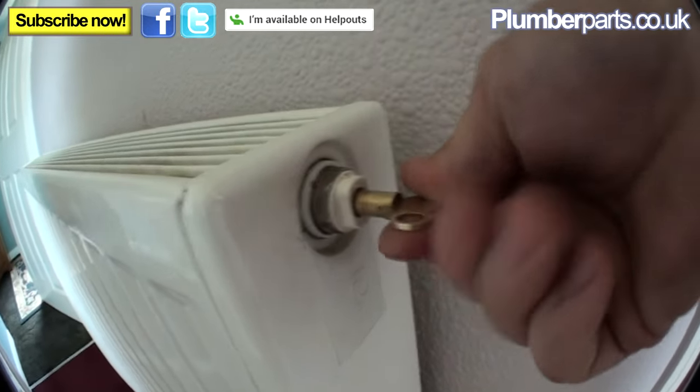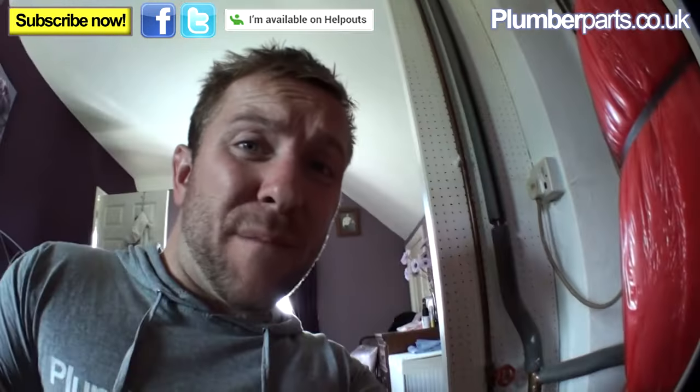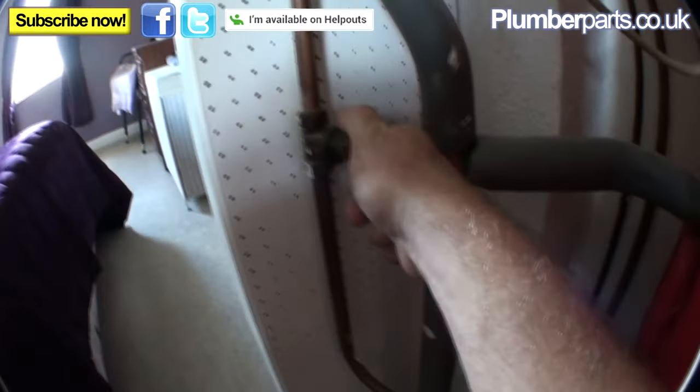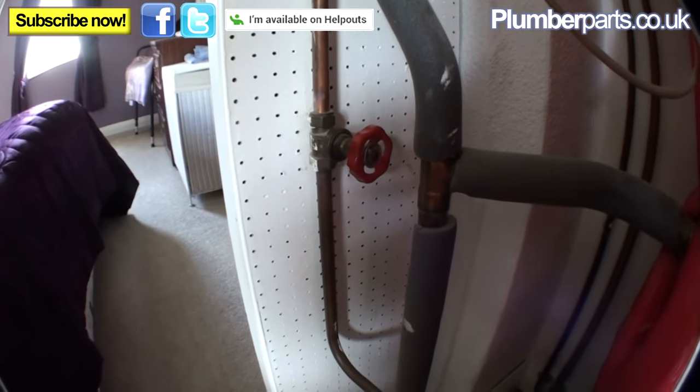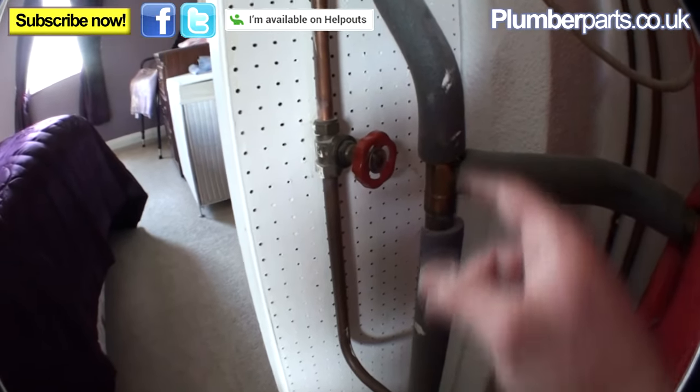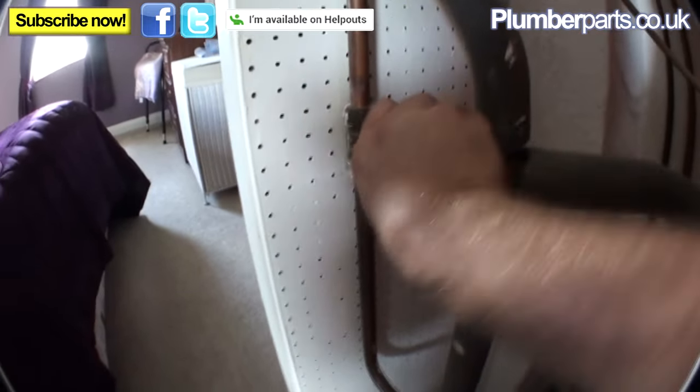You'll notice I turned it clockwise to shut it. So we're back in this little airing cupboard here. This is our feed valve to the system that we turned off earlier on to do the other work. What we're going to do is turn this on. We know now that all the air vents are shut, but we've kept the ground floor drain off with our hose open. The idea is we're going to open this up and push out any air out of that hose before we do anything else.